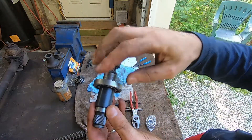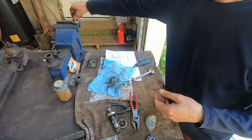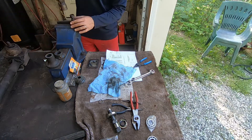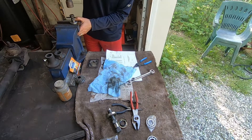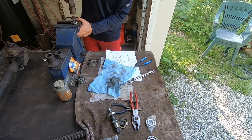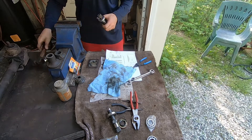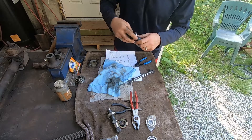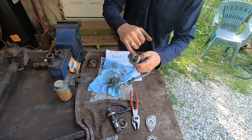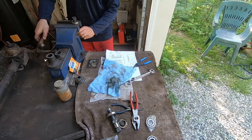For the output shaft I'm replacing this bearing. To get it off the shaft it doesn't just come off, so I'm going to drop it in the vise and give it a little tap — I've put the nut back on the shaft to keep the threads safe. I did need to take a snap ring off before it would come off. This bearing is hard to come off because blade wear on the flat surface of the shaft over time has caused that shaft to mushroom a bit, so I may have to file it before I put the new one on.